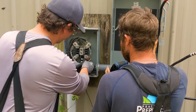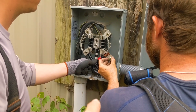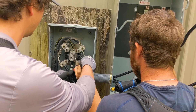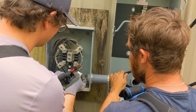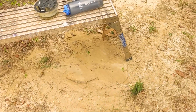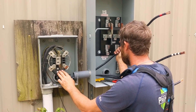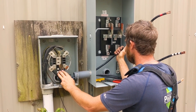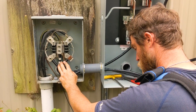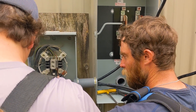On some jobs we need to have the meter removed, so we call the utility and they send out a meter tech to pull the meter — they sent out the turkey slayer. Otherwise we get in serious trouble for breaking a seal and pulling the meter ourselves. We're putting in a double-pole double-throw switch for our feed from the solar to the shop. We're very thankful the utility came out today and pulled the meter. Once we get the conductors landed in our transfer switch, they can put the meter back and we'll be good to bring in our generator or solar on the other side.